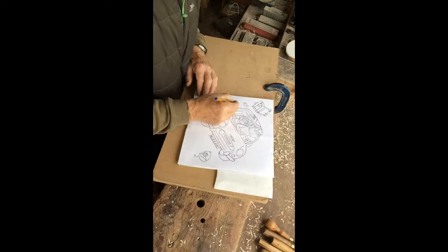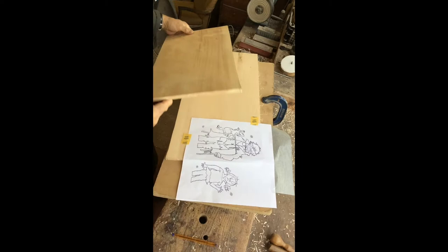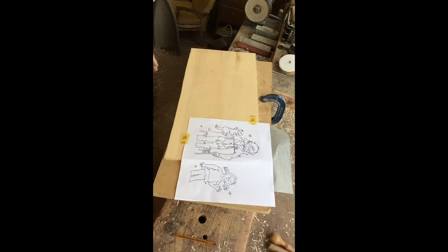It will all be as the original drawing was done. Here is the special wood that I carve — it's very thin and it's a wood called lime. Then we have to place the drawing over the piece of wood that I'm going to carve and trace all these tiny little lines, which are going to be the markers that I carve up to.